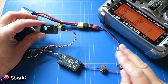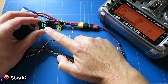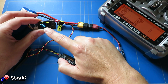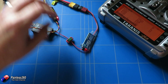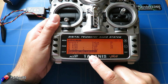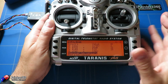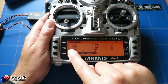The challenge is by default you only get one reading. Here on this little image we have the 11.9 volts reading for the battery voltage. We can see that each of the individual cells — cell 1 is 3.96, cell 2 and cell 3 is fractionally higher at 3.98 volts. However, if we actually look on the radio, we are discovering our sensors and we have just one thing called receiver battery and something called CELS.